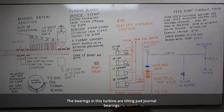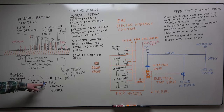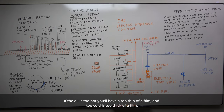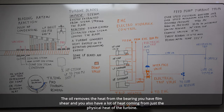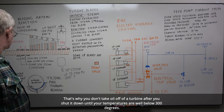The bearings in this turbine are tilting pad journal bearings. The reason for that is better stability of the bearings and a better stability of the oil film. Your oil wedge is about a thousandth of an inch thick and depends on temperature — that's why temperature is so critical on bearings. If the oil is too hot, you have too thin a film. Too cold oil, you have too thick a film — it can create vibrations and problems on both ends. Too cold oil can actually be worse than too hot oil. Your oil removes the heat from the bearing through film shear, and there's also a lot of heat coming from the physical heat of the turbine — 600 degrees here transferring heat down the shaft. That's why you don't take oil off a turbine after shutdown until your temperatures are well below 300 degrees.